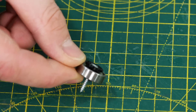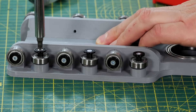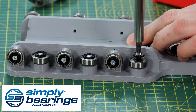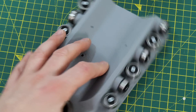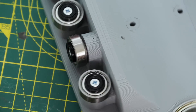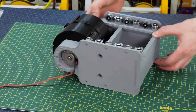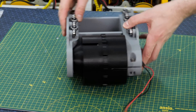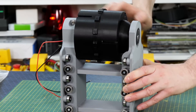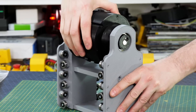These parts are special — lots of little bearings with a small 3D printed cap, fitted at 90 degrees to each other on each side, with a washer on the inside to space them so they don't rub on the plastic. We now have a unit representing one end of the tank: the motor fitted inside the wheel with a powered sprocket between two pieces, and all those bearings serving as aligners for the track.